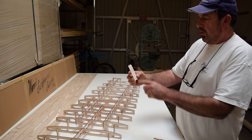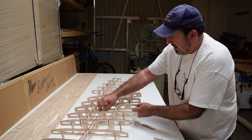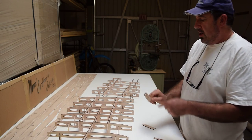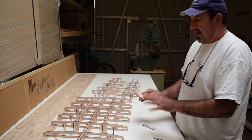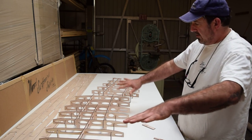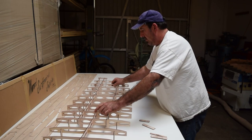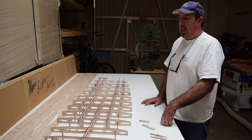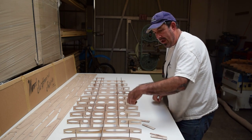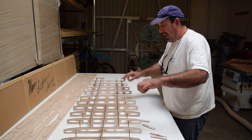The Tucker Tabs are little tabs with notches, and there is a corresponding notch in each one of the ribs. Each tab is pre-measured and numbered, and the ribs and other parts are numbered as well, so you don't have to cut anything — you just slip them all together. This one is not glued, it's all just dry fit, and as you can see when you drop it on a flat table everything is just the way it needs to be. The next step would simply be to attach it to the table. There's a lot less work because the tabs are already provided.